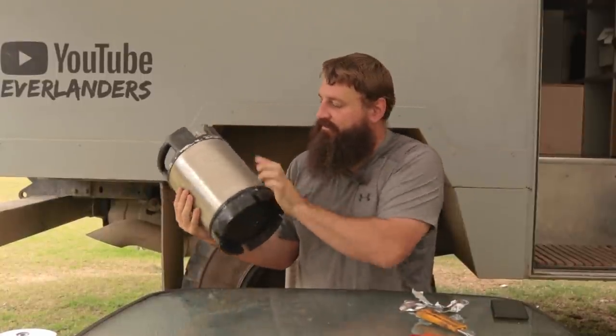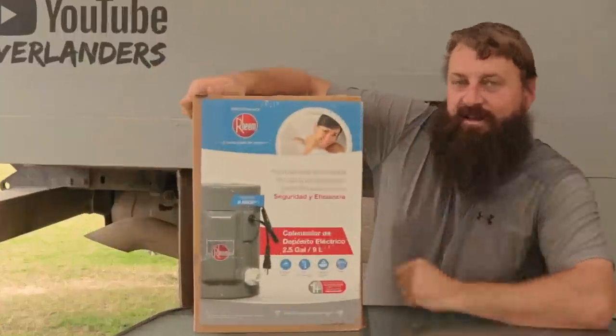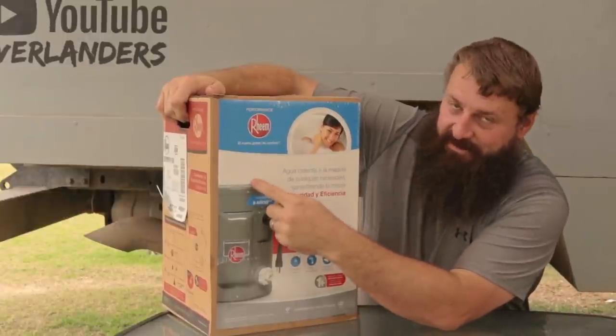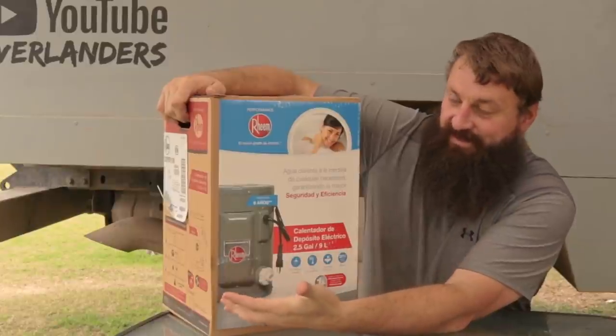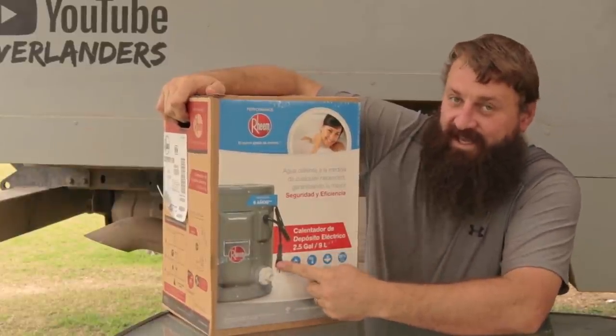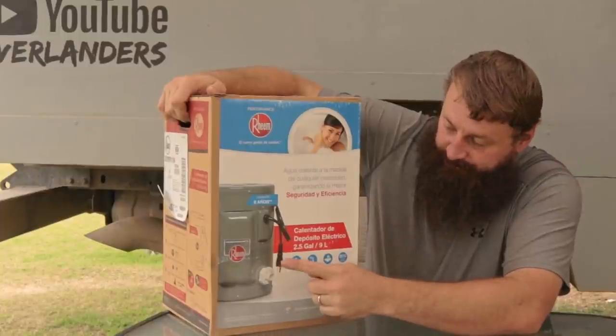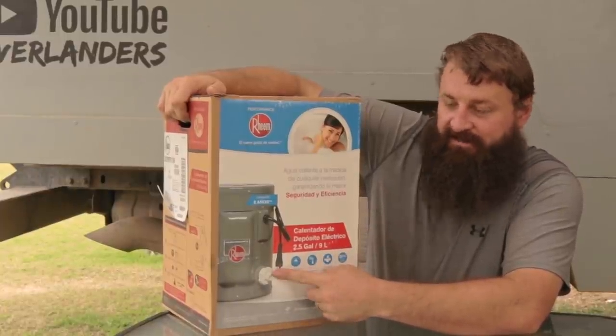Here's my keg back to normal again. Just in the traveling around we've been doing in Mexico, we find a lot of these really small cute water heaters underneath the kitchen sink or the washroom sink — that's a point-of-use water heater. They're a lot more common here than in homes in Canada and the US where you have a large 50-gallon water heater. So I started looking into it and found this little unit. Happened to be at Home Depot, 20% off, and it's got all the right fittings we need to make a proper water heater. It's 120 volts, so I can run it directly off our inverter, or off a grid if I have access to that. But I'm going to convert this and make it 12 volt.